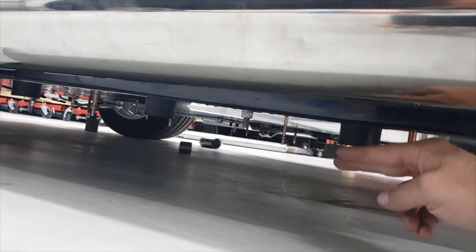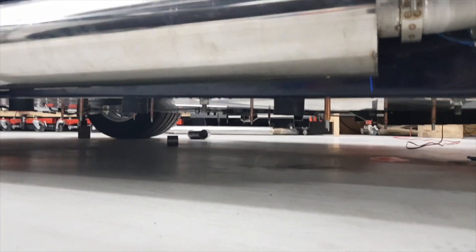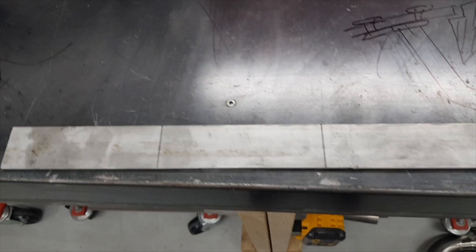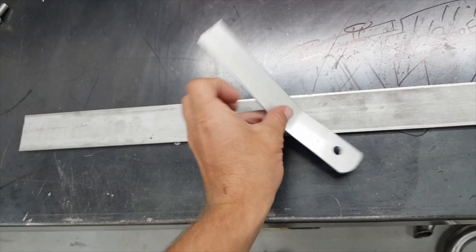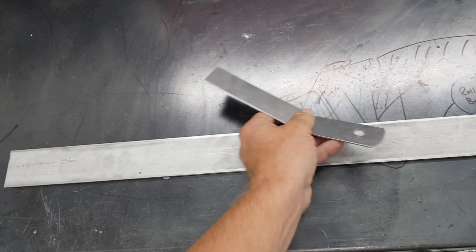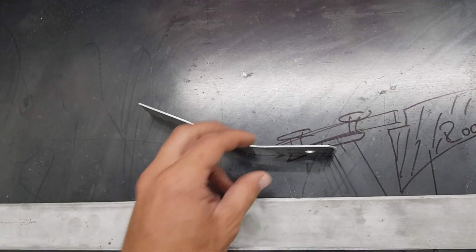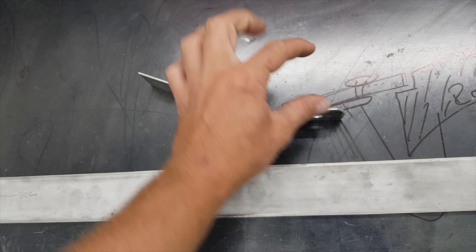I chose three mounts to spread the weight out more. The idea is to bend a bit of stainless plate and weld it up to the bottom of the exhaust. I've fitted three rubber mounts on either side, lined up where I want the exhaust to be. I've got some 50mm wide stainless plate, and it's relatively the same style as what the Cobra uses — but on mine I didn't want the extra space that would make it the lowest point under the car, so I've opted to bolt up to the rubber mount from underneath.